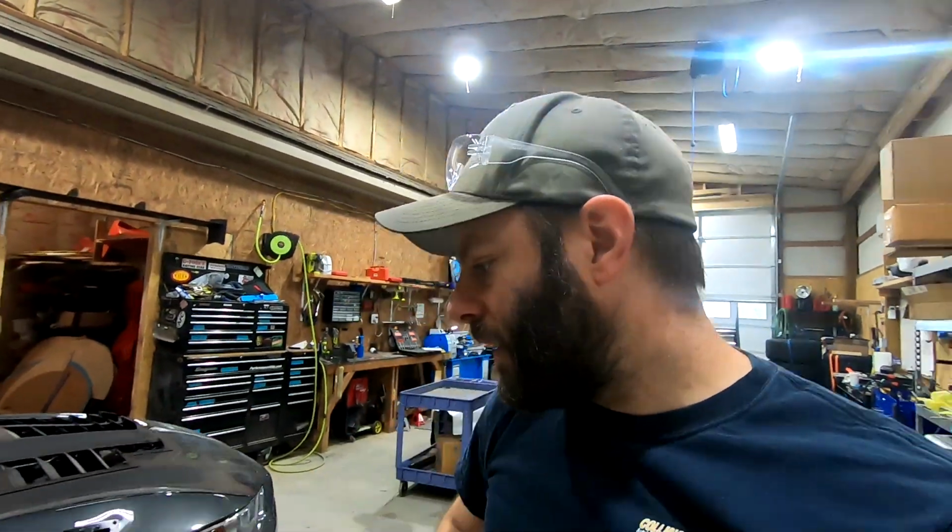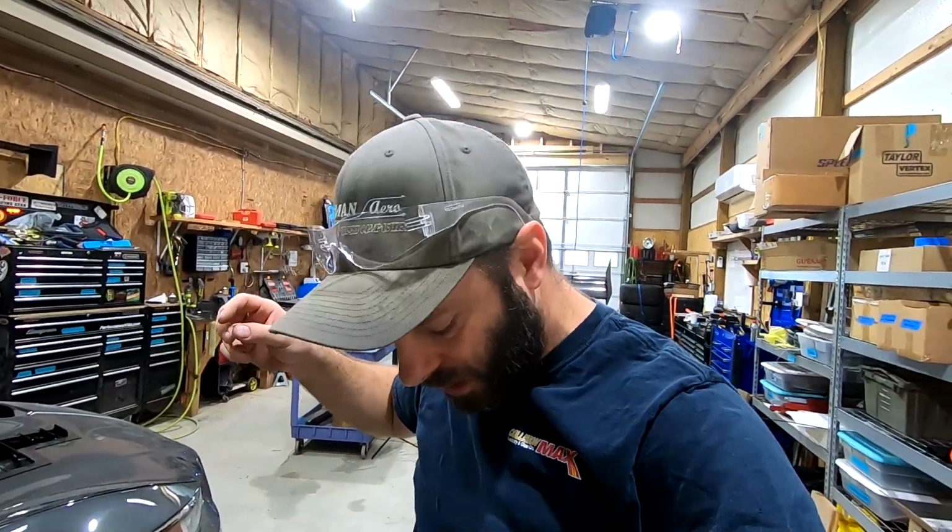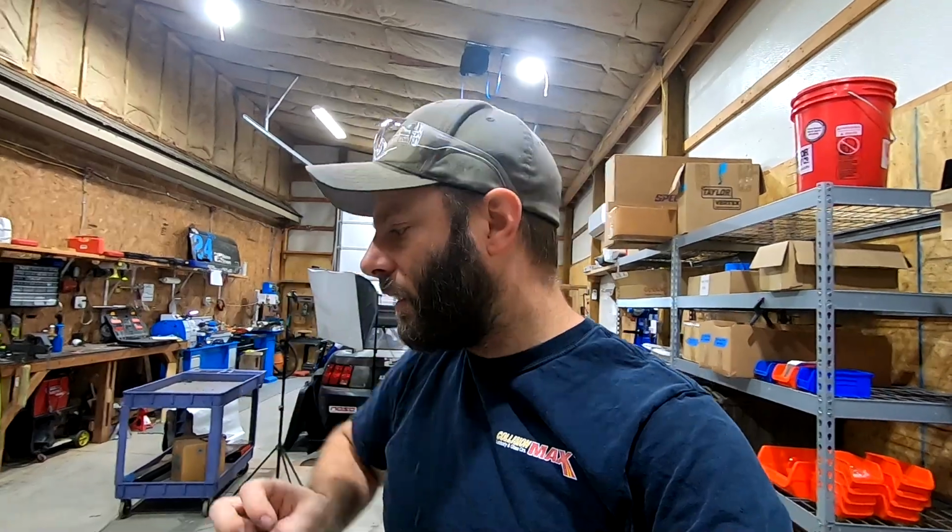Now they're already in the other side. We're gonna let it down and see what we get just by locking out the springs, because this situation is probably what most people would do. Like I mentioned earlier, with my coilover conversion kit, the spacing of everything, that spring actually has some extra space in it. If you have some sort of coilover that has a helper spring, which only has, I don't know, maybe a 20 inch-pound spring rate, you could probably push the spring down or up, either one, and kind of do the same thing. But let's see where we're at with just locking up the spring first.